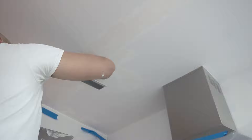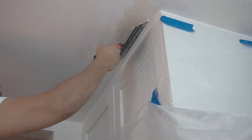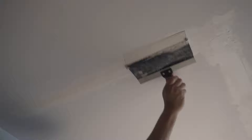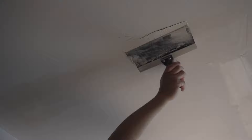This is going to take a few tries, especially when you're working on the ceiling — it gets very tiring on the arms. It really numbs my arms, but it has to be done. So we're going to feather it in again on the edge. I apply a thick coat on the end and then feather it out. This pretty much just requires technique and finesse. Now we're going to go over the crease on the light fixture, fix those bumps. Once you get enough thickness, feather it in at the edge and fill in all the empty spots, going in different directions to fill those areas.